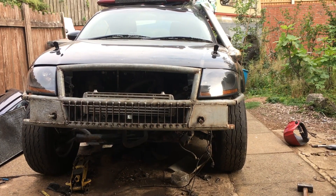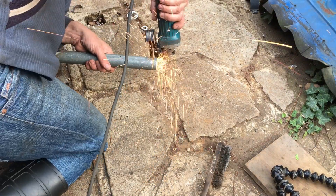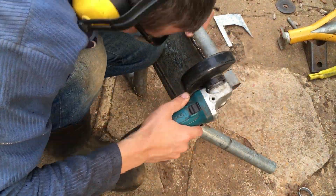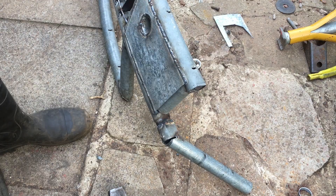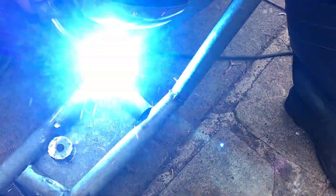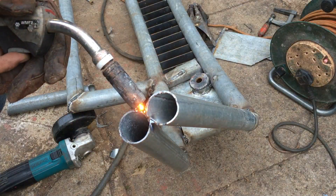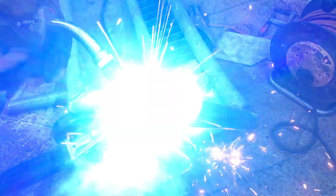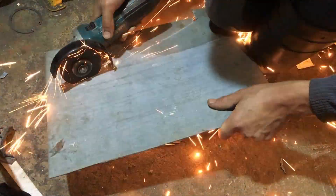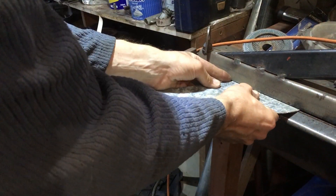Time to complete the sides. I'm going to start by trimming the top tube back so that it finishes where the wheel arch starts, and then cut the bumper's lower tube short and triangulate it to the free end of the top tube. Rather than measure and calculate everything spot on before cutting, it's sometimes easier just to mark it up and trim it until it works. Once it's welded in I can trim the back end too and then weld the two tubes together. The real strength will come when we fill in between the two with sheet metal. This piece is going to start on the front of the bumper and wrap around to the side, so I'm going to put in several folds close together to create a single bend with a larger radius. The folder is really useful for this, but otherwise I'd probably form it over a piece of scaffolding bar with a hammer or a mallet.